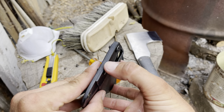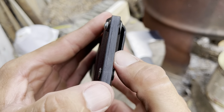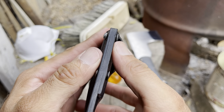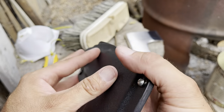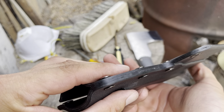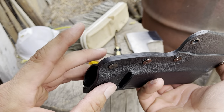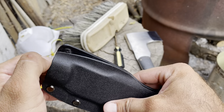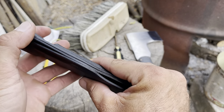I didn't take the corners off on, and here's a bit of a separation actually. I didn't take the corners off of, I just wedged them together and then took only these corners off, because I wanted to be as close as possible. So that's one thing to do. Just put it all together, and then sand it together, and then sand the parts that are not together when you have the pieces apart. But everything else, just do everything at once.